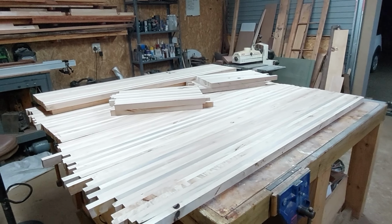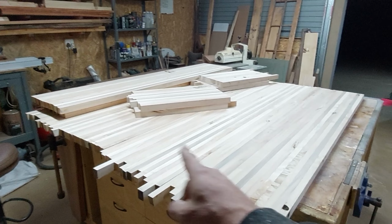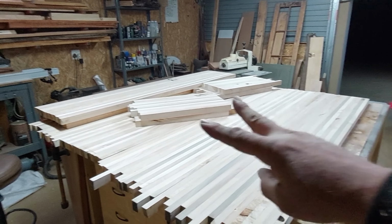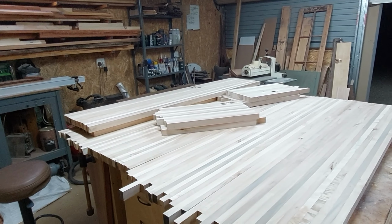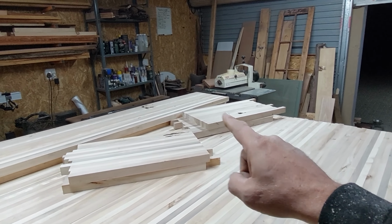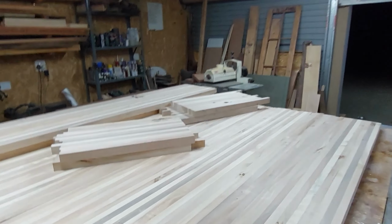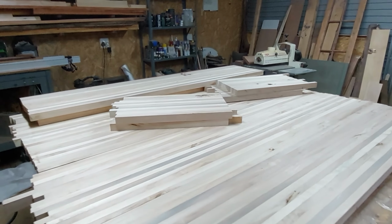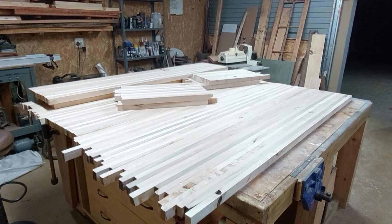That's what the 148 little strips glued together looks like. The big part in the bottom here, that's going to be 1.6 by 1.6, the tabletop. The four small ones are the legs for the two benches that we're going to make. And every here and there you'll see some black marks. That's not holes, that's holes that I filled with black resin. I used wood cast, clear cast resin from AMT Composites to fill that. And we'll sand and finish that later.